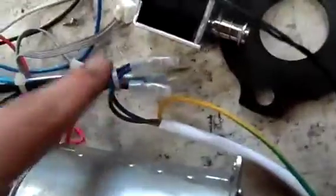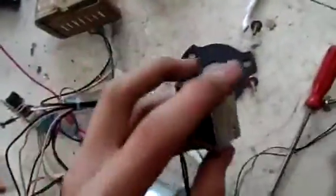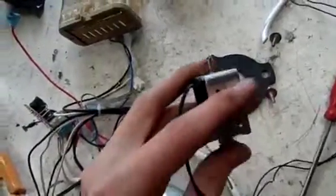connections, and then two of those actually go into here. And then power goes out back into that loom set and then into this, which then goes into the motor. There's also a 220 volt solenoid which would control the fruit nut dispenser. It's just got a series of levers that little pin there just shoots up and pushes that little button at the back which opens or closes that flap, so that's fairly simple.